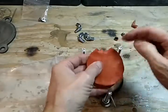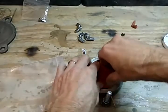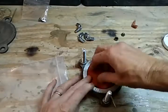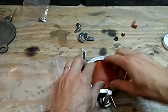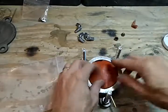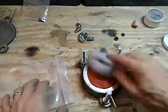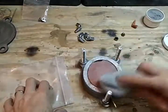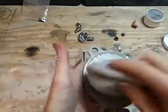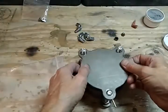Now we'll take the final piece — we're going to put that part up towards the top because the area down here with the funnel, I want that to fill completely without any voids. Once we get to this point, take talc and talc the top of that really well, and talc the top of the mold holder really well too, because we don't want it sticking.